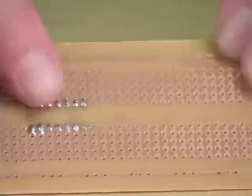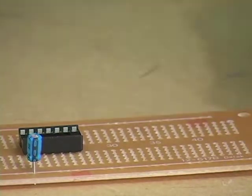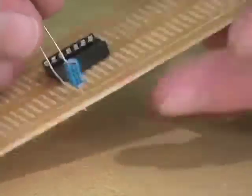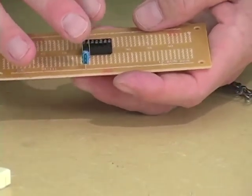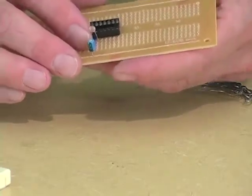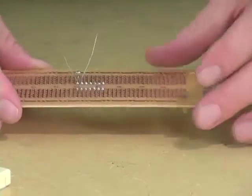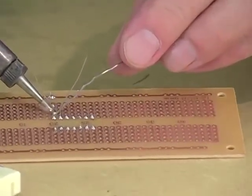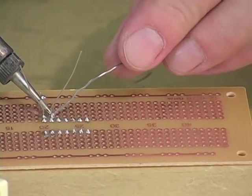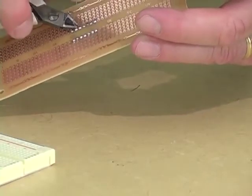If you leave the excess wire sticking out of the bottom, it can bend over and short against something else. We have a photoresistor between pin one and pin two. You want to think about how high up you want it to be. If you stick it up in the air, you can mount this in a box and have it stick up through the top. We'll make a little compromise and make it as high as the capacitor, going between pins one and two. Solder each leg and leave your iron down for the minimum amount of time to get the solder flowing, so that excess heat does not melt or otherwise damage the components.